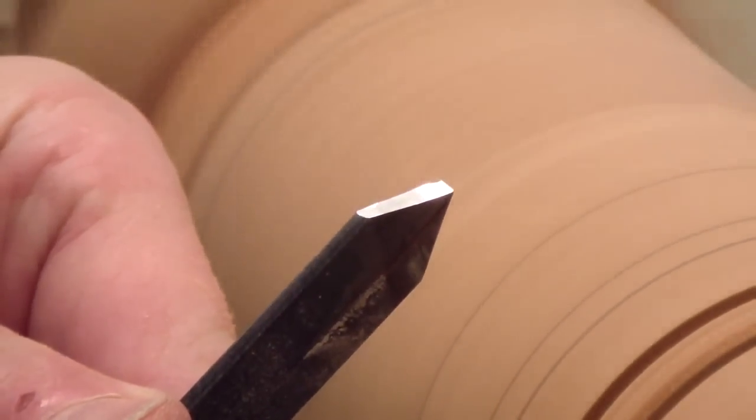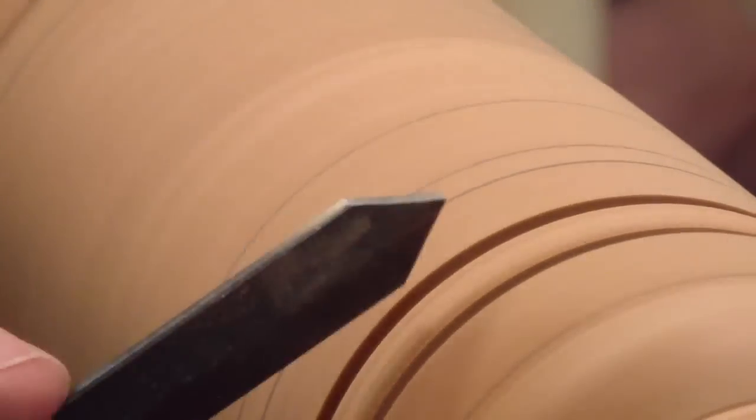Terry, why don't you put a flute in that tool? This one? Yeah, that part of the tool. When I'm turning these soft woods, I know it will pull away from my pencil mark enough. So when I come back with my gouge mark, I just catch that part and cut it. This is so fast to sharpen. I walk over it and bump it like that, and bump it like that, and it's done.